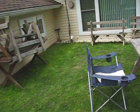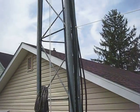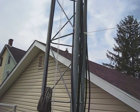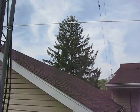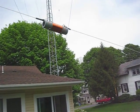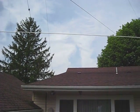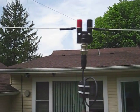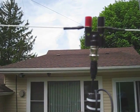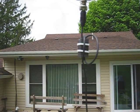What I'm using with this KX3 is a 12-foot long 20-meter dipole. It's only tied about 8 and a half feet above the ground onto the tower for right now. We go out — here's the end insulator and we go to the feed, here's the loading coil — remember this is only 12 feet long for 20 meters, and here's the feed point. For now on this feed point I just use a banana jack, RG174 coax, 15 feet long, and a simple balun that you can make.